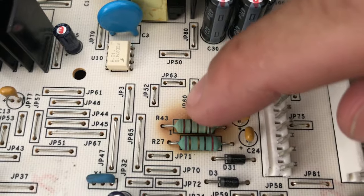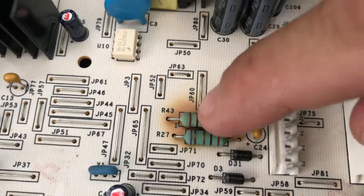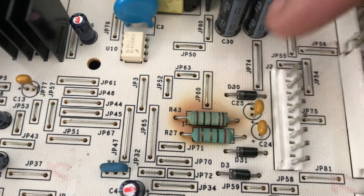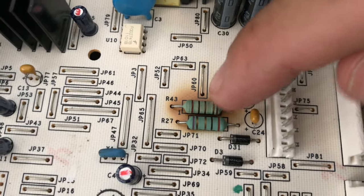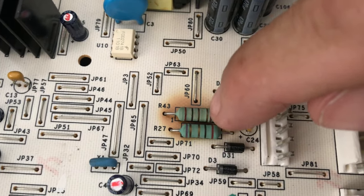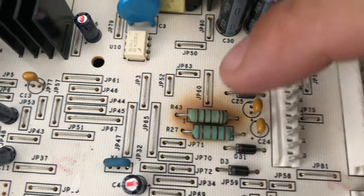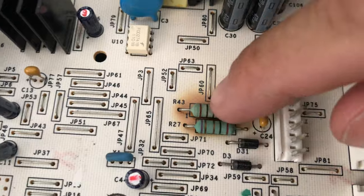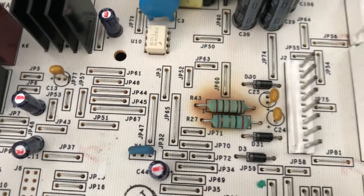From my research, you can replace both of these resistors if you can find them. Find the right resistor based on the color stripes — the stripes tell you the specification. A lot of guys on other YouTube videos have posted the right resistors for it. You can also Google the different resistor types. They're pennies on the dollar versus calling a service tech.